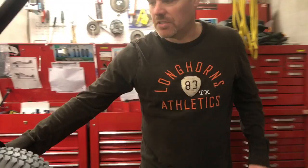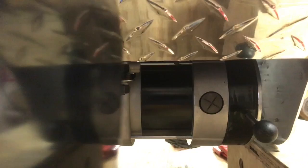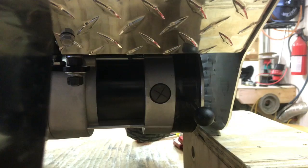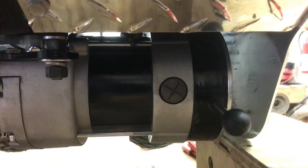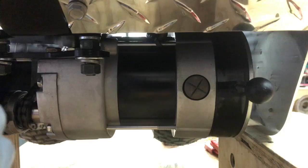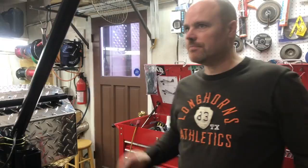One other thing I want to show you: down here is our motor. There's a little handle. What this handle does is — down means the internal parking brake on the motor is off, and if I go up, the parking brake is on. The difference is when it's down and I hit the throttle, you really don't hear much. When I turn this on, you'll hear a definite clicking when the brake releases. And if you're on an incline, you definitely want to have the brake up in the engaged position.